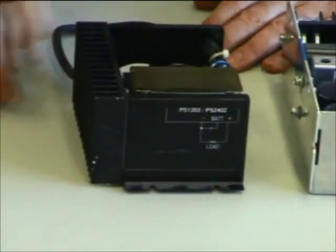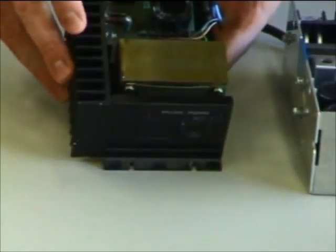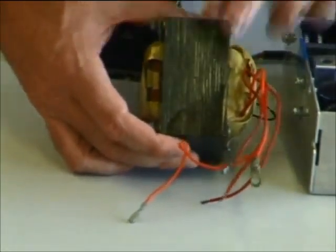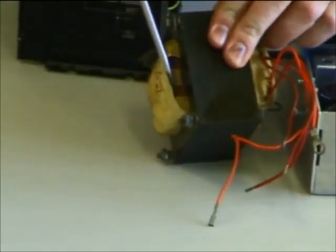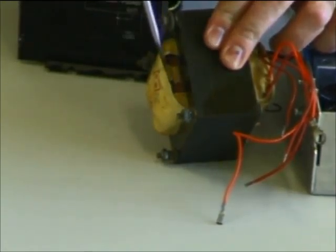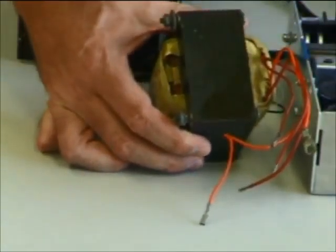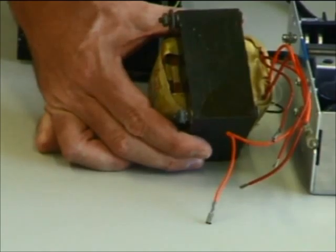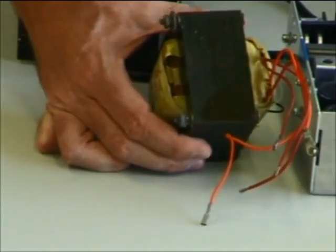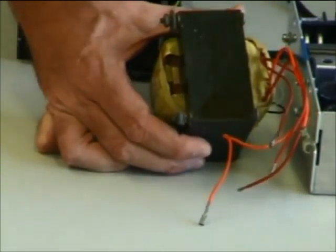Here's a complete power supply we'll come back to later. There's a transformer with windings side by side. You can see the primary and secondary windings — quite large copper wire because it's carrying higher currents in the secondary winding. The primary has the same power but at higher voltage and lower current; lower current in the primary, higher current in the secondary. Because the current is higher, the wires have to be thicker, otherwise you get more voltage drop or I²R losses.